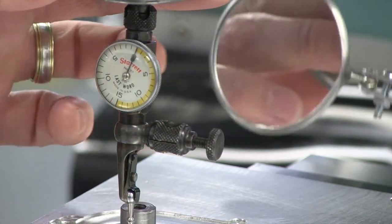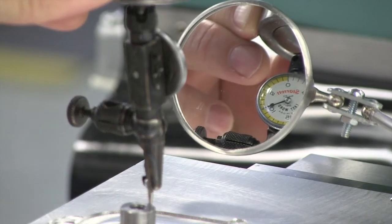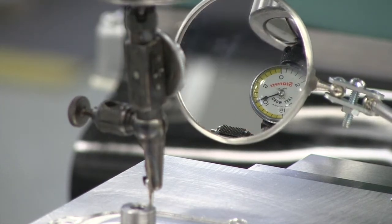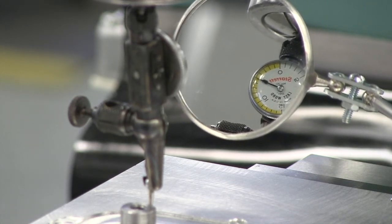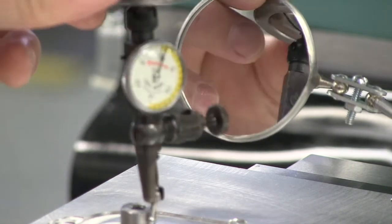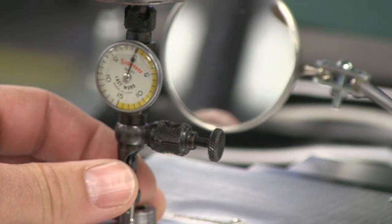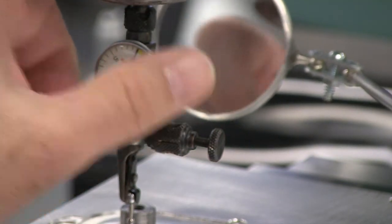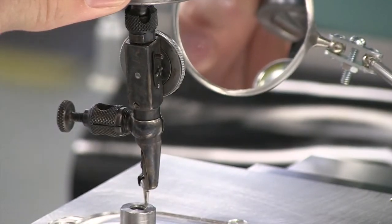In the front I'm at zero. In the back, it looks like we're at about nine thousandths — we're in the yellow, about nine thousandths. So what I'm going to do is divide nine in half; that's about four and a half thousandths. I'm going to move to about the four and a half thousandths spot in the y direction. We'll come back and set our zero again. And we're back at zero — let's rotate and see where we end up. We're pretty close, within a half a thousandth.